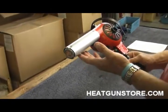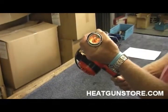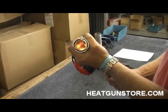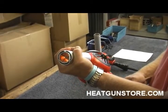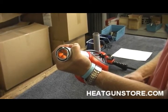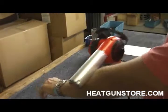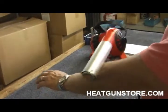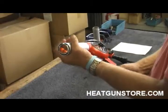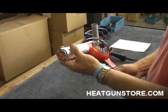With this double-insulated nozzle and shield, I can hang on to the gun. Now, if you can see the end of that heat gun, we're producing 1,000 degrees. The external temperature of the nozzle is never going to get over around 100 degrees. It'll be warm to the touch, but never hot. I'm not going to burn myself or burn any of the material that I'm working with. That really is a critical safety factor for anybody using a heat gun.